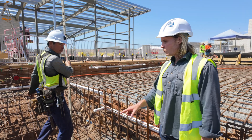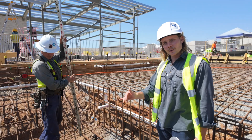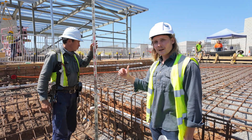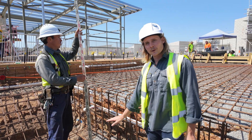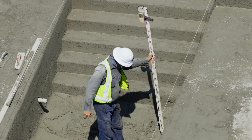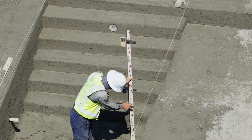Sammy's got the laser out right now. With these pools, it's crucial to have the perfect height. We've got 1.2-metre depth here, so Sammy sets up the laser to height and the bottom of the laser will be the perfect pool depth. We'll ping that through the whole pool to make sure we're perfect on height — same goes for the beach entry. That's how we get the appropriate heights, not just spraying and guessing. This will be height-correct to the millimetre.